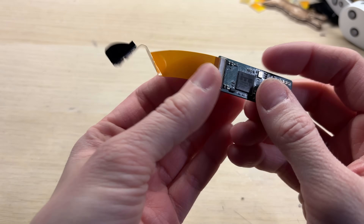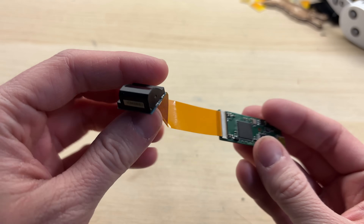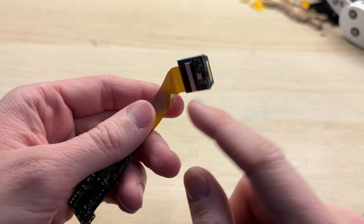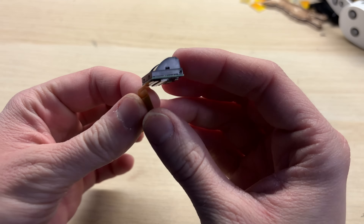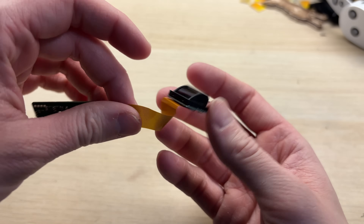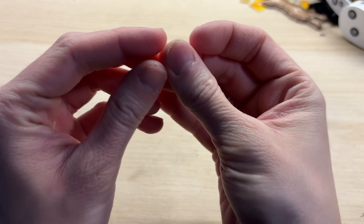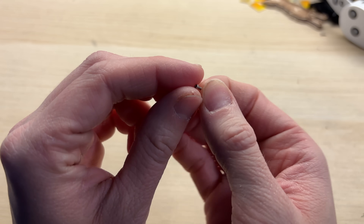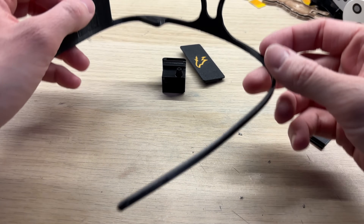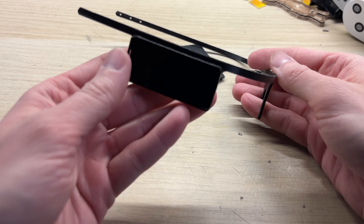For this build, you will need a 0.4 inch FL-COS micro display, along with the micro HDMI driver board. You can easily find them on Aliexpress, but I will put some links in the description. As you may have already noticed, the FFC is bent at 90 degrees — this is absolutely required for this to work. You will also need a couple of self-tapping screws, particularly the 1.5 mm. It will also require a couple of 3D printed parts. You can find all of the required files on my Patreon page.